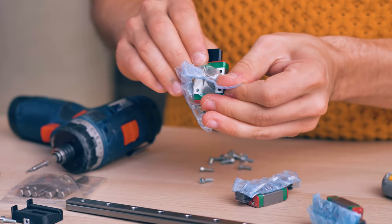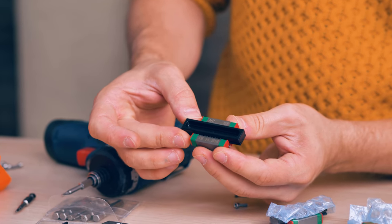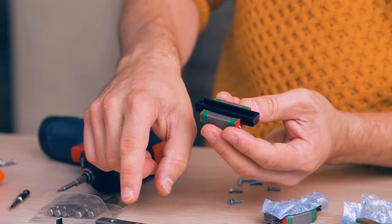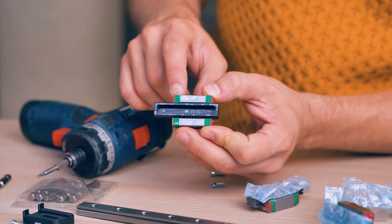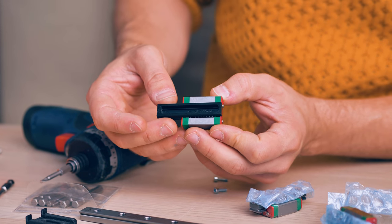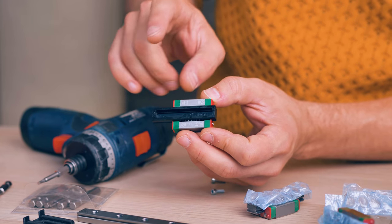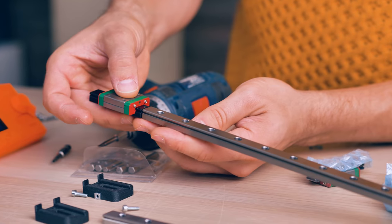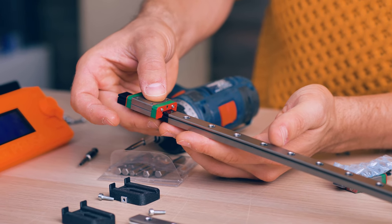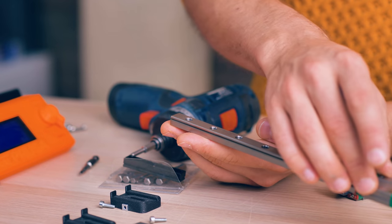With these blocks, make sure to never just remove the center assembly guide without actually mounting it onto something else, because if you just take it out you're most likely going to lose some of the bearing balls that are inside. There is a retainer, but they're not super secure. So that's why you need this mounting guide — basically, you just butt that up to your proper slide and then slide it over onto the rail.